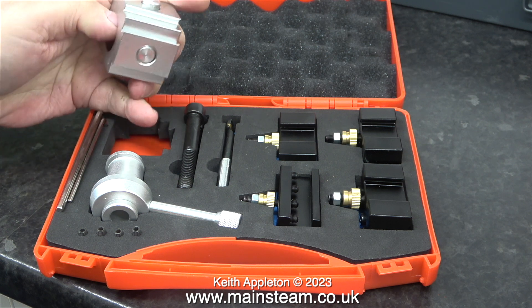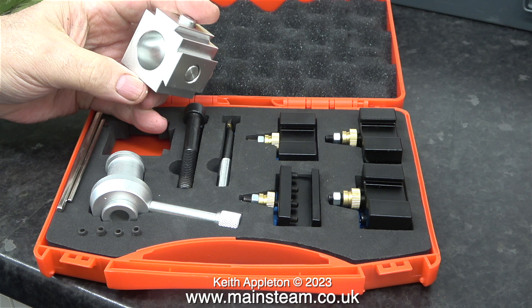I also received quite a few comments about this tool post — a Chinese tool post made from aluminium, and it was £38. I bought it just out of curiosity, thinking I'll waste £38 if it's rubbish and throw it in the bin. I used a different metric mounting bolt just because I didn't like the look of the standard Allen bolt, and I packed the mechanism with lithium grease to stop it wearing out prematurely. It's worth remembering that Chinese stainless steel seems to be nothing like any other stainless steel I've ever seen, and this aluminium seems to be very hard stuff, quite different to any aluminium I've ever seen before.